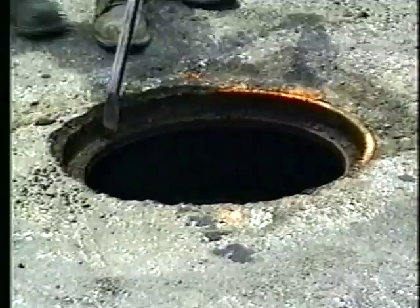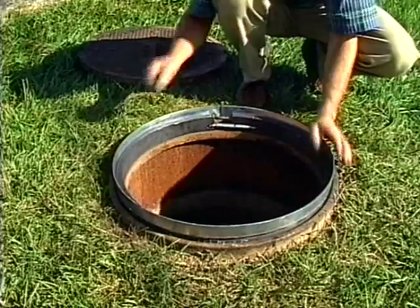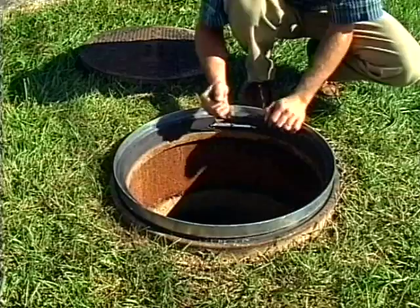With the opening clean, insert the manhole riser. Make sure the riser is at the bottom of the hole. You can ensure that the riser is seated properly by tapping it down with a hammer and listening for any voids. You are now ready to expand the pivoted turnbuckle — use a Phillips-head screwdriver as a lever, turning until the riser is engaged the full circumference of the hole.